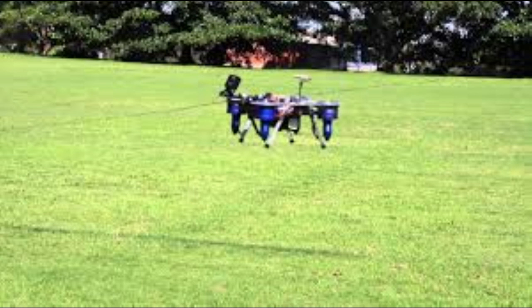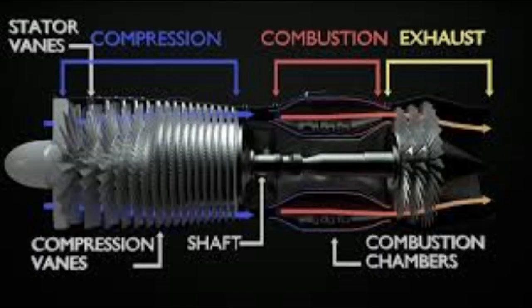The results will actually be quite intriguing. First of all, being able to shrink a jet engine down to size and still keep that level of efficiency — with 80 to 90 percent bypass air — will be quite hard. That will be one of the biggest challenges with adding a jet engine in place of props in a quadcopter.